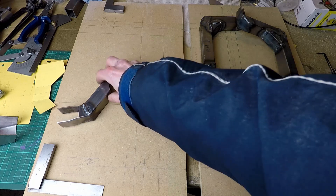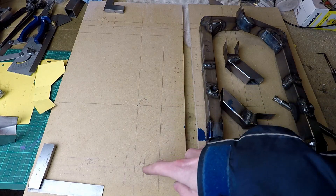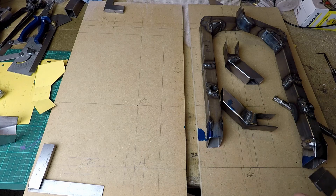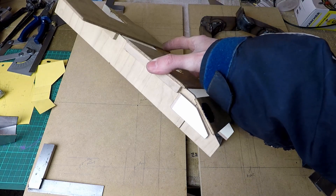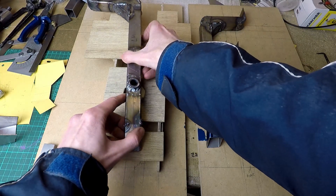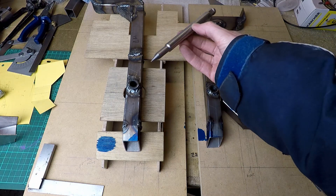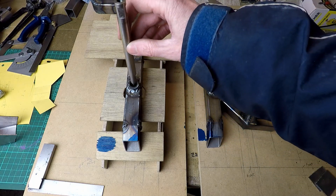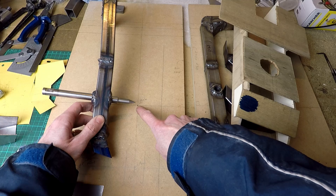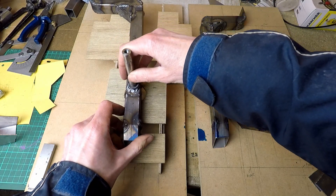What I've done is I've marked out the elevations on two pieces of MDF — that's for the right hand one and that's the left hand one. I've marked very accurately the pivot locations and the axle position on this board. And I've also made this simple jig made out of plywood which fits accurately over the pencil markings and has allowed me to tack weld the parts together in the right orientation. Finally, to make sure that everything's in exactly the right position, I made this little pointer which goes through the axle hole and locates in the centre mark that I've made in the board to accurately locate the position of the axle and hold the arm in precisely the right position as I tack weld everything together.